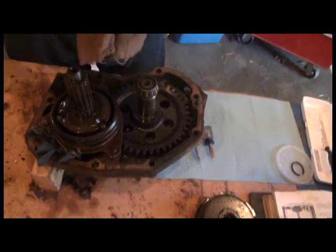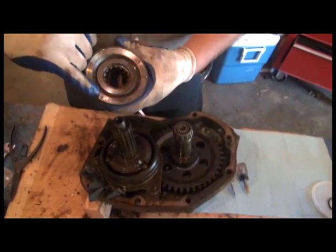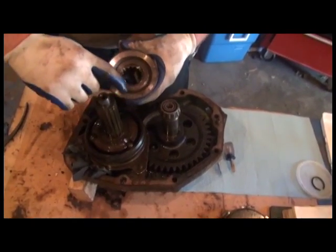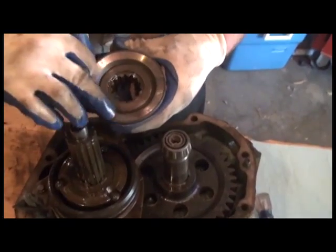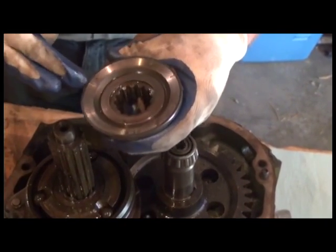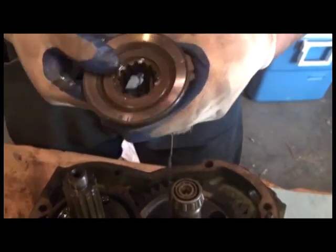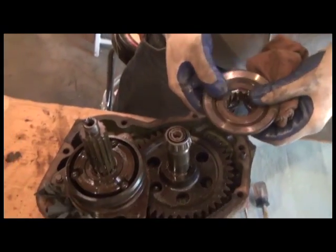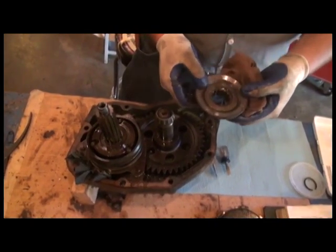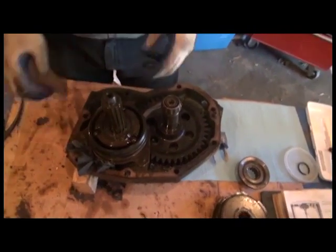And I always take time to observe the wear. You can see this clutch has been adjusted several times, as there are wear marks where these little ball bearings ride in and out as it snaps over center. It'll wear grooves and it'll get in different positions every time you adjust it. So this one appears like it's been adjusted at least 3 different times in its life, which is slightly less than normal. I've found them with deep grooves worn in there, but this part should be just fine, shouldn't warrant the need for replacement.